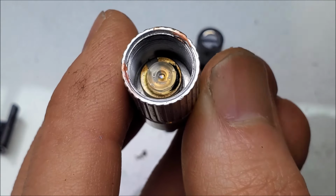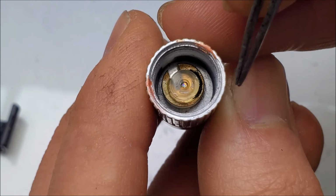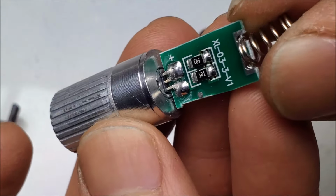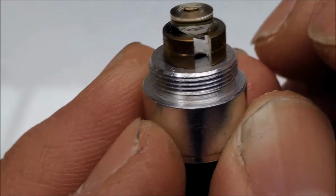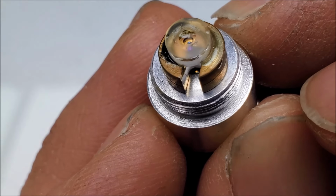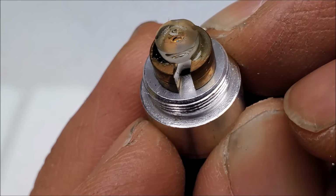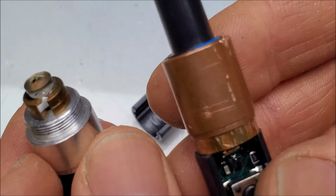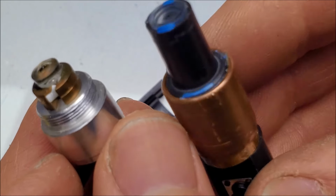Well, at least one thing stayed consistent, and that's the brass monolithic crystalline assembly holder. But other than that, yeah, practically everything has changed otherwise. And not for the better. Yeah, I figured real quick before we do some tests, I'd take that front aluminum spline section off, and sure enough, we can see that this also has those 2 lenses for condensing the beam down on the monolithic crystalline assembly. So, the only one that doesn't have the 2 lenses is actually the oldest one, which has the crystal assembly pressed up directly against the output of the diode.